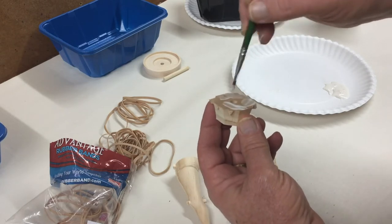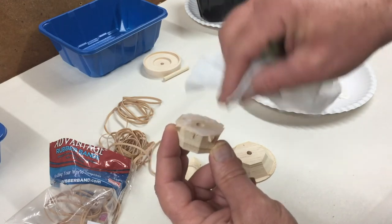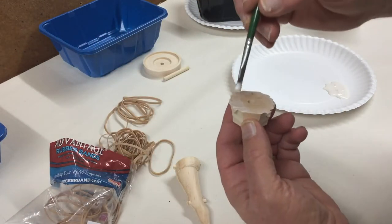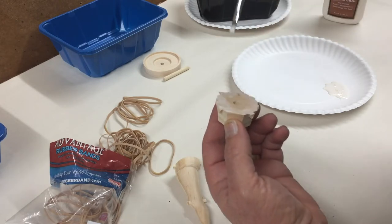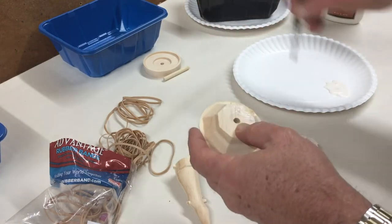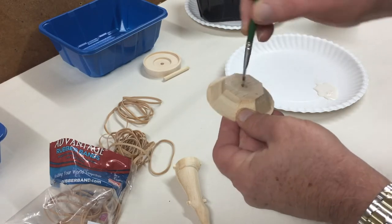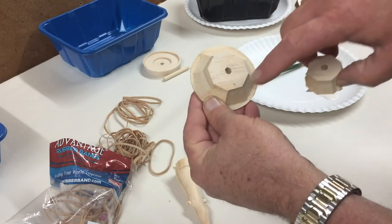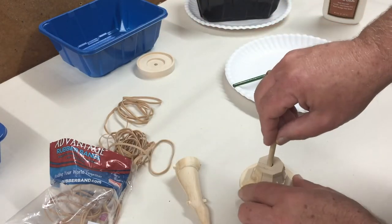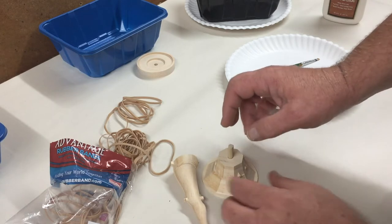I'm applying glue around the perimeter here and I don't want to get any glue into this hole — so that's a little too close, I'm going to wipe that off. Later on, we'll glue a quarter inch dowel in that hole, but right now I'm just going to use that dowel as an aid in aligning these parts together. I'm not gluing the dowel in place yet. So I'm just applying a thin layer of glue to both surfaces, making sure there are no fuzzies that would interfere with the glue-up. I've got my alignment marks and my two inch dowel, and I'm just going to use that to help align these parts. I'm not gluing the dowel into place yet.